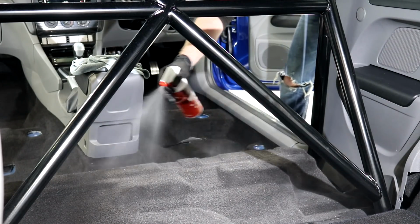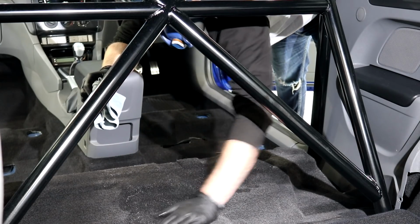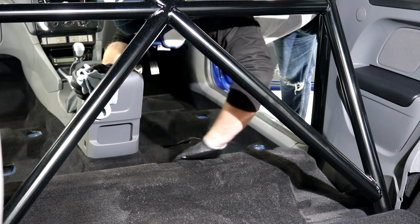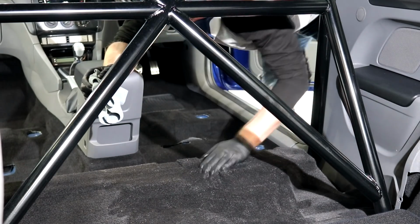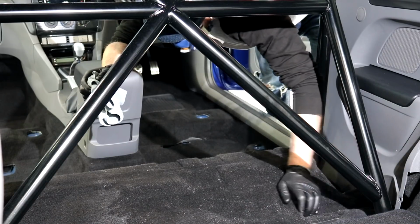Let's say for example you missed a spot in a corner whilst applying the product, and when you do rub your hand across it, you should feel that that missed area is far catchier in comparison to the smooth and wet treated sections. If there did happen to be a section that you missed and you did wipe over it with your wet glove, you have then spread the product and treated the missed section successfully.